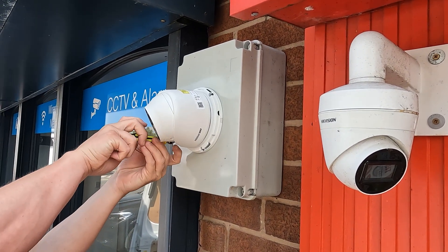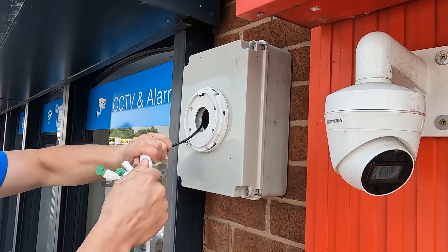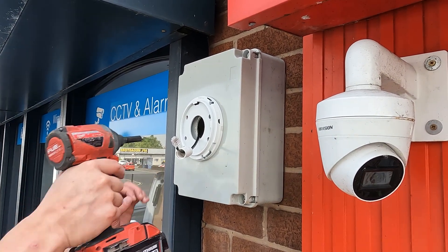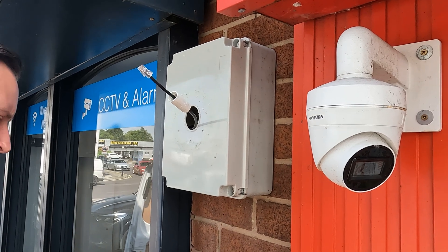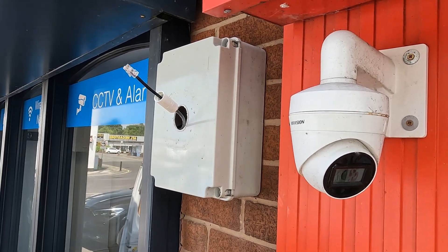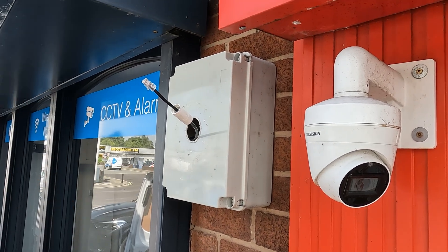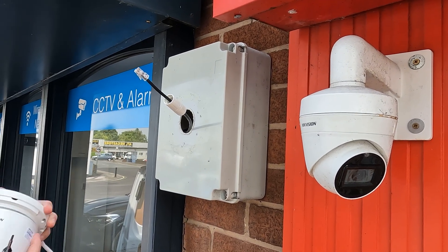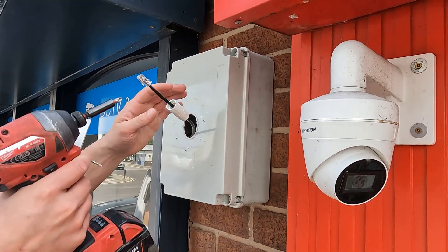Swapping the camera on our test rig is pretty straightforward. I just back off the T10 or T20 Torx bit at the side of the camera which releases it away from the base, making sure to keep hold of the waterproof connector as I disconnect it. With the old color views I could have just swapped the cameras over as they would click onto the same backing plate, but I want to put the color view base up and put the dark fighter back away. This camera being an IP camera, it uses network cabling — very similar to what you'd find in the back of a router at home.